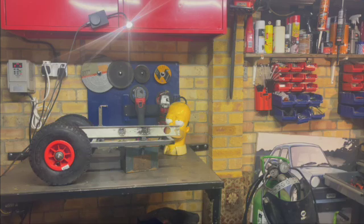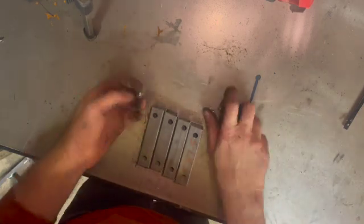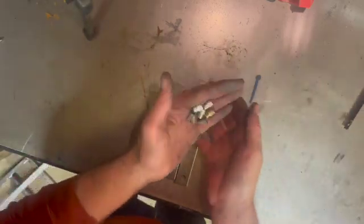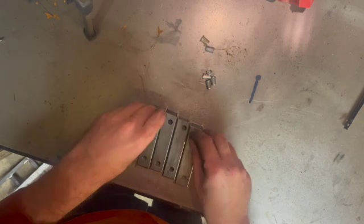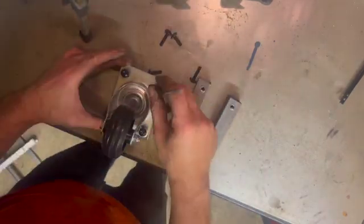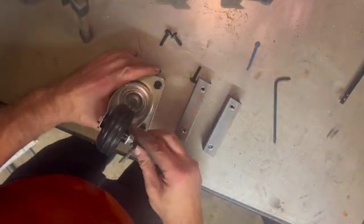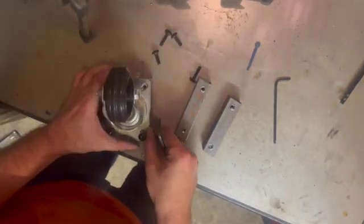So I had to get some more box section, cut it to size. I've got some M6 riv nuts there, big fan of riv nuts. If nobody's used them before, maybe I'll stick a link below. I've drilled 2 holes in each piece of this box section, and I've riveted the riv nuts in there, and we're just going to bolt these caster wheels to the box section. As you can see here, got some M6 Allen key head bolts. Okay, again, just using stuff that's kicking around the workshop.